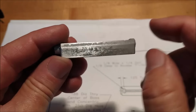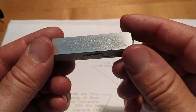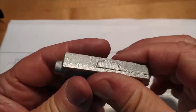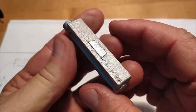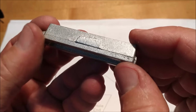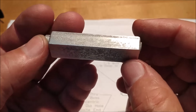So look between whatever surface you have, or put a piece of paper under there, feeler gauge, whatever, to determine what you got. If it is bowed and you squeeze it, you're going to straighten out the bow temporarily. When you machine it and release it, that bow is going to return. So that's especially critical with the dovetail. At that time, you need to know that everything is going to be nice and true.